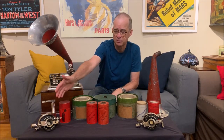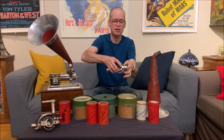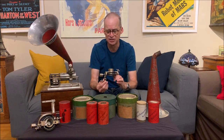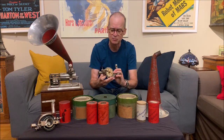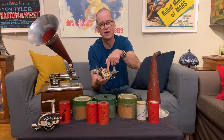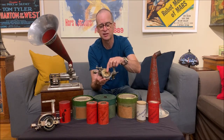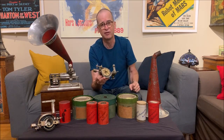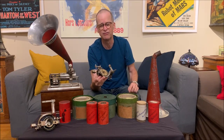He invented a microphonograph reproducer — here are two — and a microphonograph recorder. Part of the reason why his phonograph reproducers worked so well was they were a more intricate and detailed design, much more innovative than Edison or Columbia at the time. One of his features was what he called the spider — the stylus is here and it's attached to this thing, which is connected like a spider's legs to the diaphragm. It's a much bigger diaphragm, which gives it a much bigger sound.